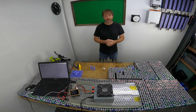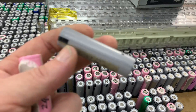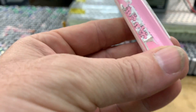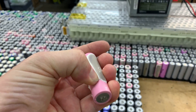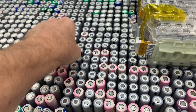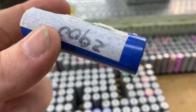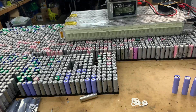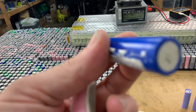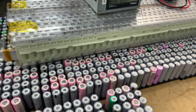Hey, welcome back tubers! Today I've got a beginner's guide for how to re-heat-shrink your 18650 cells a little bit faster. In front of me I have a little re-wrapping to do — I'd like to change everything to the gray color for consistency, and also remove all the yucky bits off each cell. Some have sticky bits, some have white stuff to chip off, others have black gunk, and some have tape. I want to take all that off for aesthetics, how fast cells come in and out without sticking, and also for extra airflow to help keep the cells cool and a small weight benefit.